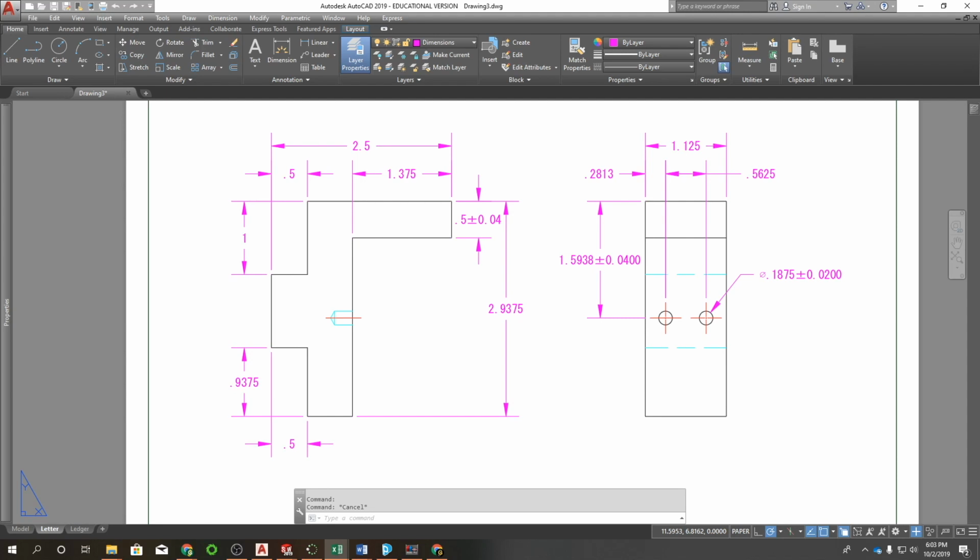Now that you've dimensioned your prints, let's add some tolerances to those prints. No part is ever perfect, as you can already tell. So what we'll do is take the measurements. If you have them written down, great. If you didn't, go grab the part again, remeasure it, and apply a tolerance to at least 5 dimensions